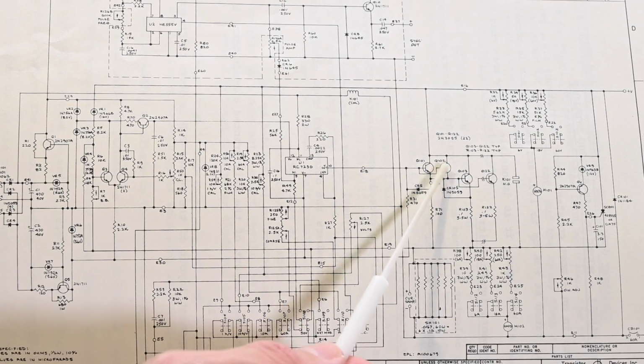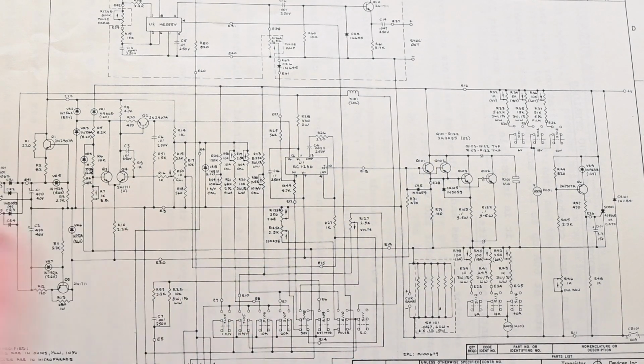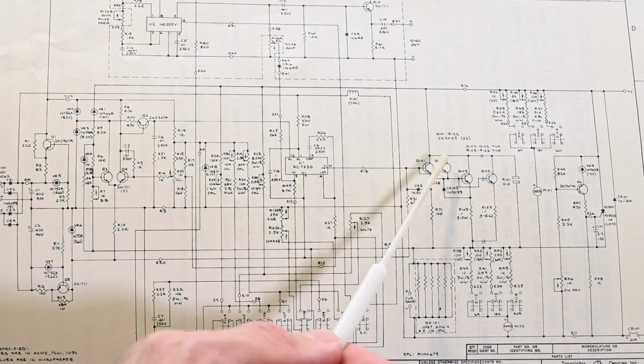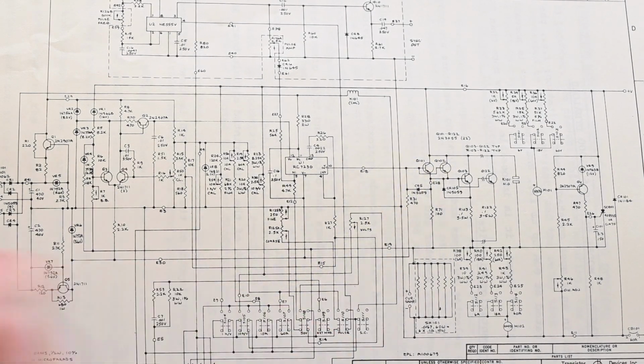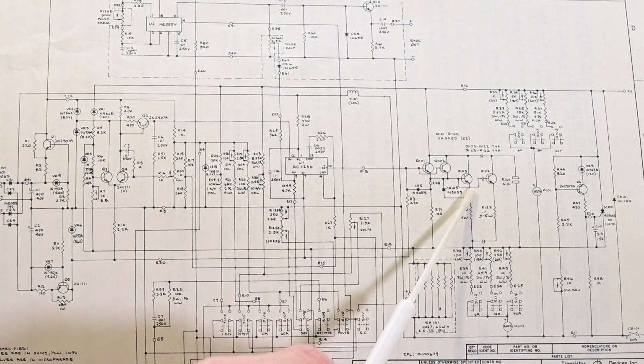And then on the two driver transistors, I'll order up the new 2N3055s, and I'll get maybe 6 of them. And then I'll match out of those 6 the 2 closest and use those as these 2 drivers, and I think that would work perfectly fine. So if these are matched at a higher or lower gain than the rest of these, it won't matter at all.